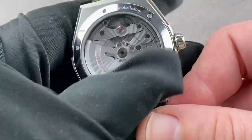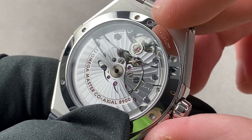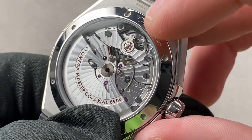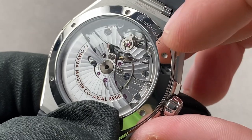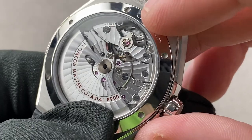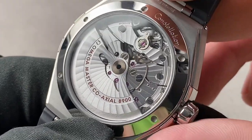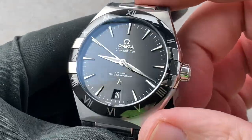This watch also uses the latest tri-level co-axial escapement — a direct and indirect tangential contact, double-impulse style escapement system. Both contacts are tangential, which extends the power reserve, reduces service needs, and improves long-term timing precision. George Daniels invented it in 1974, and today it can truly be said Omega has realized the full potential of this co-axial system. We have Arabesque Côte de Genève across the bridges as well as the rotor, with both polished and blackened screws. All told, it is a machine-finished but very handsome movement, with a silicon hairspring and an almost amagnetic specification.